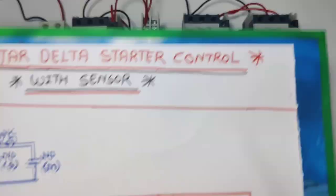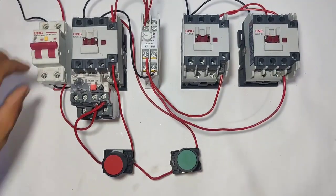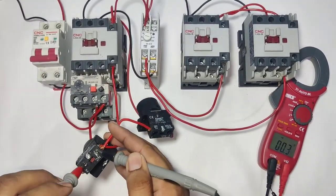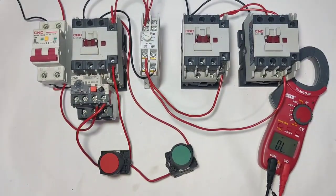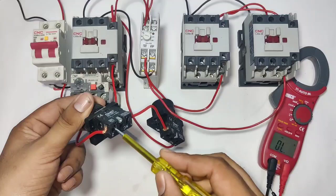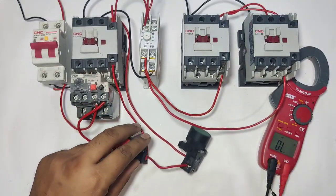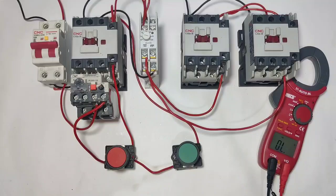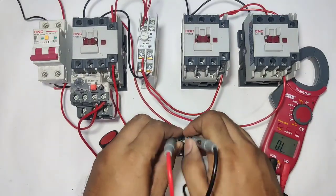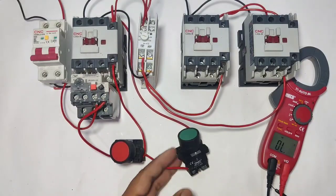Third, check the NC push button and NO push button. For checking with multimeter, stop the power supply and set continuity range. The NC push button should show continuity — if continuity is showing, your NC push button is okay. For checking with a tester, it should glow and the output of the NC should be showing current in both terminals. Now, to check the NO push button, switch off MCB, set continuity range, connect both probes on NO. When push button is pressed, it should show continuity — meaning the NO element is okay, no fault in NO element.